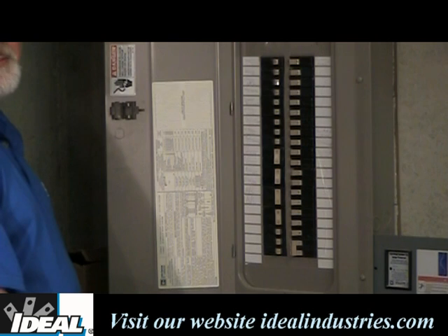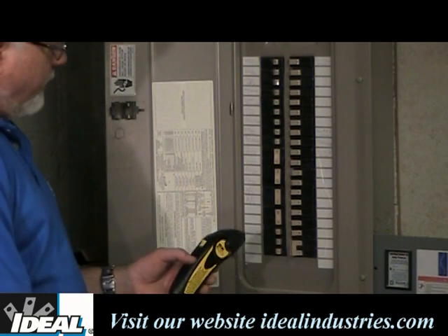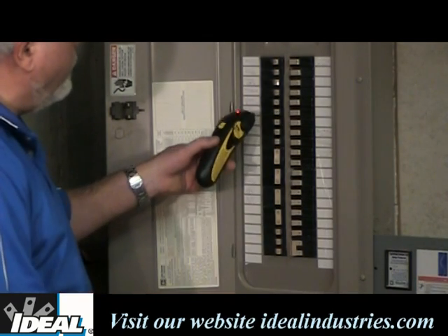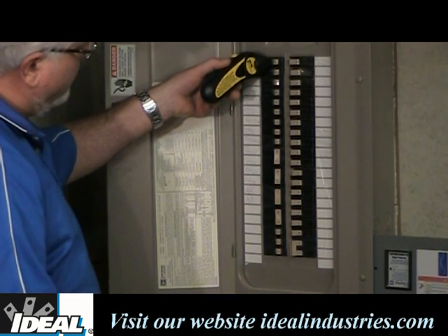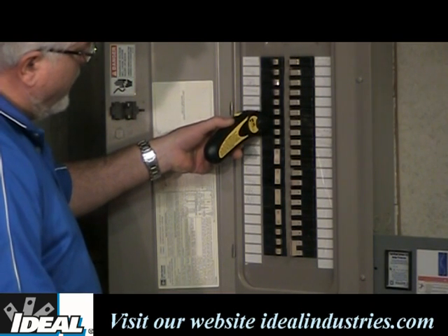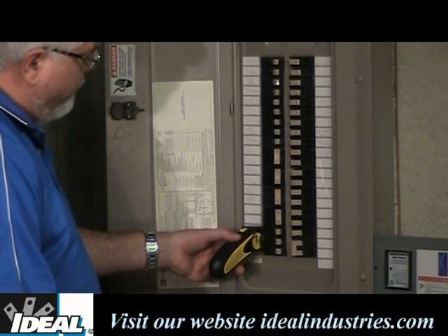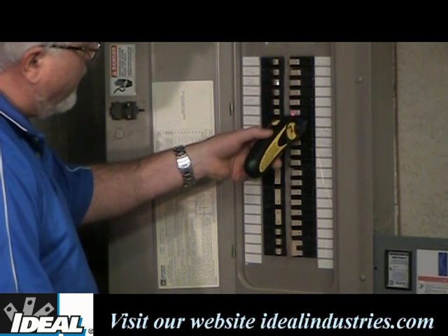Here I am back at the electrical breaker panel, and I'm going to try and locate which of these breakers the transmitter is plugged into on that extension cord. I'm going to turn on my receiver — it's got a little LED light on the top that's lit up, telling me it's ready to go. I'm going to slowly go through each of the breakers, taking the very nose of this receiver unit and holding it flush against each breaker. It's going to start beeping and making noise, identifying which breaker I'm actually trying to find. It's tuning itself into the frequency of the transmitter. That's why several of them make a noise — it's trying to figure out which one is loudest.